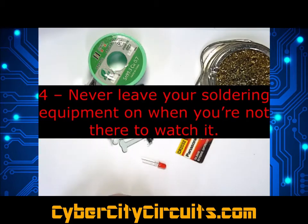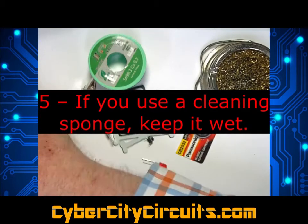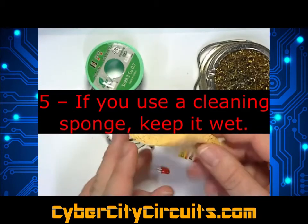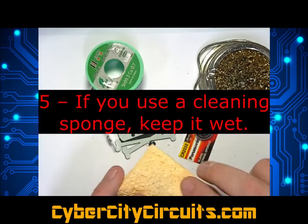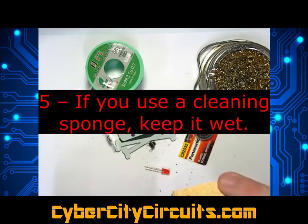If you're using a sponge to clean your soldering iron, like this one right here that's not wet, because I'm actually going to be using this, but if you're going to use a sponge to clean your soldering iron, it needs to be wet. It needs to be really wet, okay? Don't use a dry sponge to clean your soldering iron.